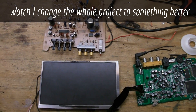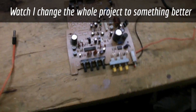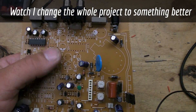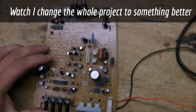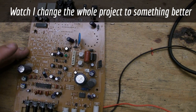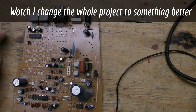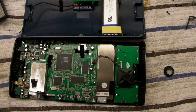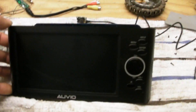This is definitely going to take probably a week or two because I've got a lot of work coming up. Quick note: those two boards run off two different voltages. This one is 12 volts, and that other board is 9 volts. So what I'm gonna have to do is build a 317 regulator or something, input 12 volts off a plug pack and break it down to 9 volts to run that other board.